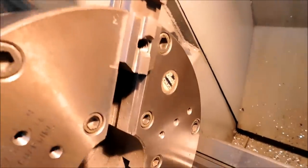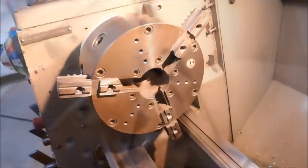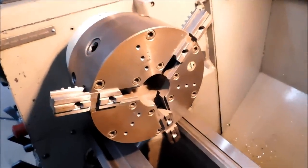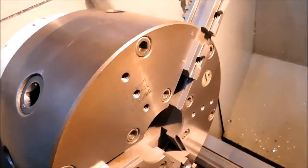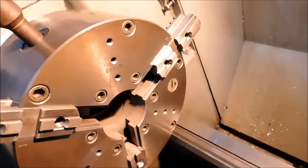Okay, so I've given myself about an eighth of an inch of grip before this jaw launches. I am not sure where that compressor kicked in and what it interrupted, but like I was saying, I've given myself about a tooth and a half to 2 teeth worth of engagement, because I just don't think it's a good idea to torque down on a hard jaw with any less than that.